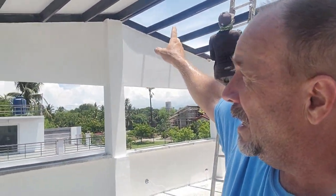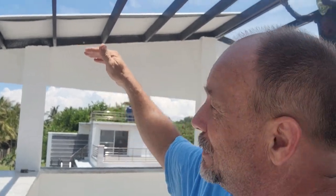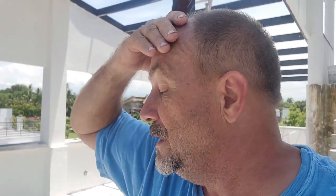So I let them off on this first sheet up here. I got up there and handled it myself with them helping. And we got our foam secured with tape at the end. They were up there. Held the foam tight up at the top. And you want to make sure your purlin's clean so your tape really sticks good. And then we slid a sheet through up here and we walked the sheet across over onto it. You don't want to drag it because it'll snag on your foam, rip your foam. Kind of lift it and set it over. That first sheet's so tricky because that fall is something else. And there is a light breeze right now. So I'm the one that was up there on top, and I put all the first screws in, with all their support and help all the way around me.